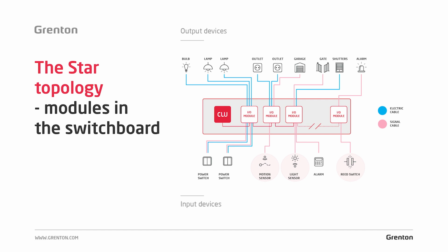When UTP is used, there is another big advantage. If today a regular switch in a given room is installed, and in the future we want to install a touch panel in that room, then all we have to do is dismantle the switch, and on the UTP cable, which is already there, we connect the system bus, and we can connect a touch panel or smart panel in that room too.